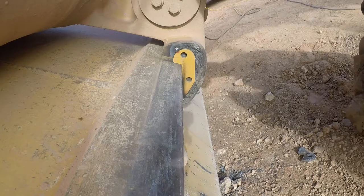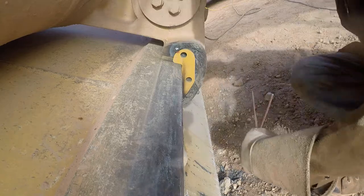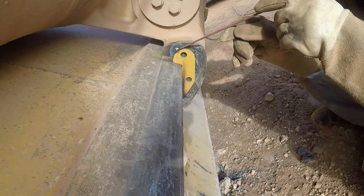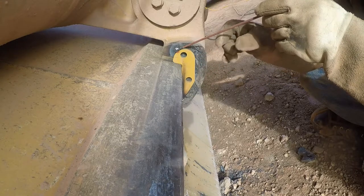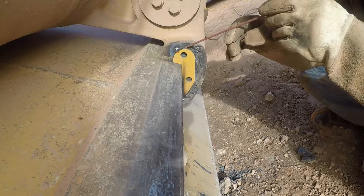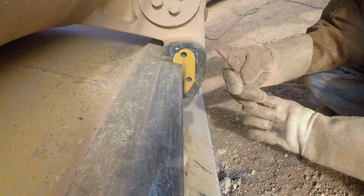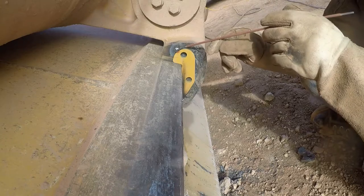Technique that I like to use. I mean, of course, I'm not a welder as a trade. I'd say my welding skills are probably average. But I like to run it downhill. I'll start welding, let it pool up right there, come out of the puddle. As it pulls up, I'll drag it back right into the middle. And each time I'm moving about maybe two rods width, because it'll puddle up pretty good. This eighth inch rod really doesn't mess around compared to the real little stuff.